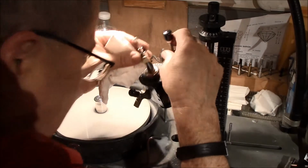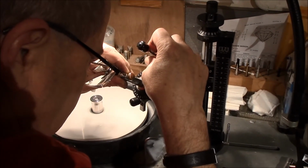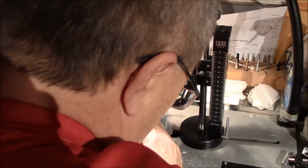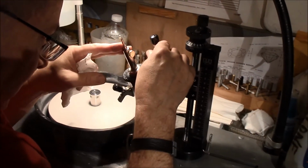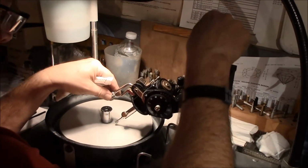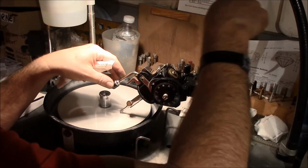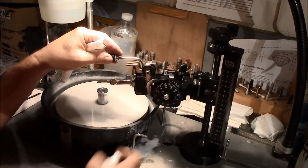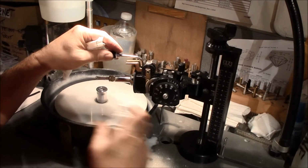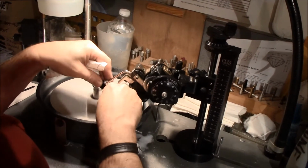Okay, well that is all of your 8 mains polished. So the next thing we'll go to is 44 degrees, which is what I cut in my breaks at. This is a 96 index, so I'll be starting it off at 3. Move this away where I won't be hitting the spindle. Might want to give it a little light blast. Try not to breathe when I spray that.